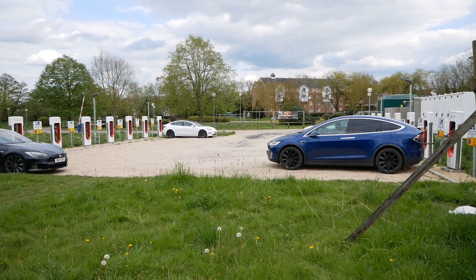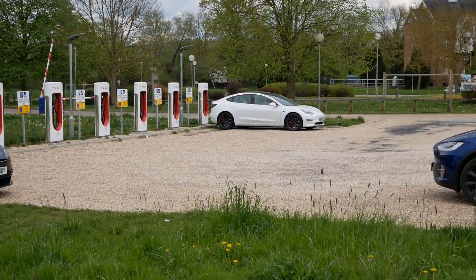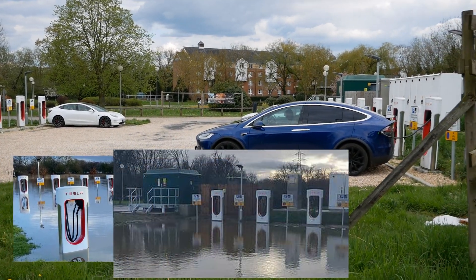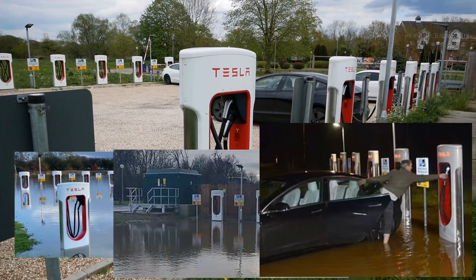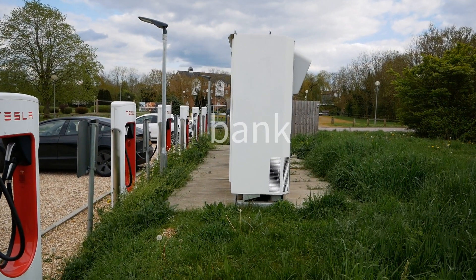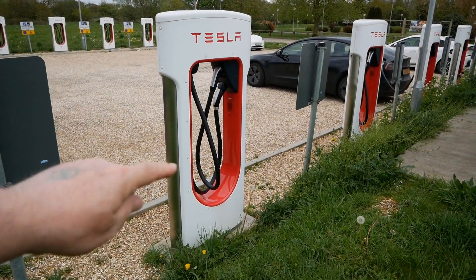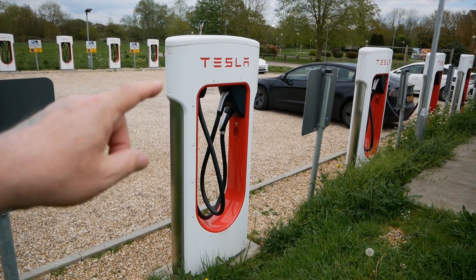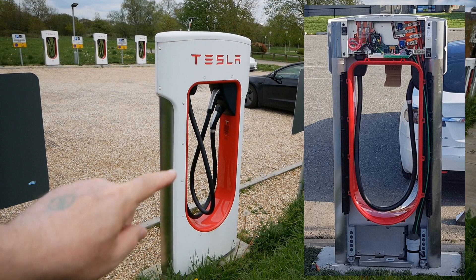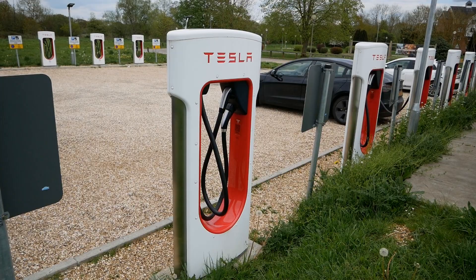This supercharging site might be familiar to many because it floods quite a lot, and when it does the internet and news media is full of photographs of Tesla superchargers underwater. They've designed this site to cope with it — all the power electronics sit up high on the hill. If you look at a photograph of these chargers with the covers off, there are no electronics in the bottom section; everything sits up high at the top. The bottom is just plasticwork, so these can stand in water to quite a depth before it becomes an issue.